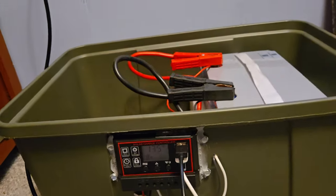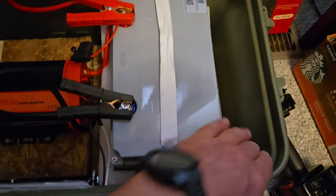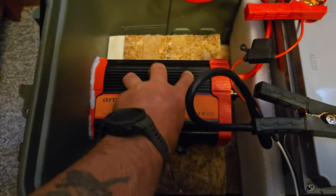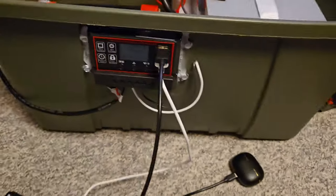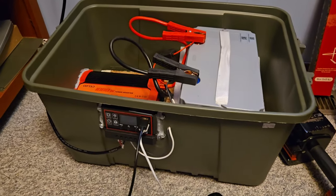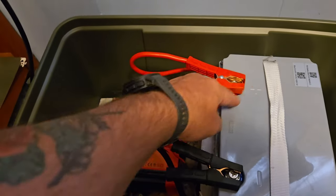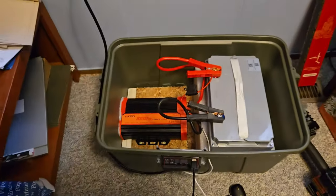The construction was pretty straightforward. I used the packing foam that came with the battery — it was shipped — on the bottom I've got some OSB the full length of the container and then the width, and we've got the inverter screwed in nice and solid with silicone sealant. Not that I'll leave it out in the rain, but in case there's bad weather when camping it'll give some help — not waterproof but water resistant. And then you've got to have the inline fuse — it's a 30 amp — red goes to the positive and black to the negative. That's pretty much it, quite easy to build.